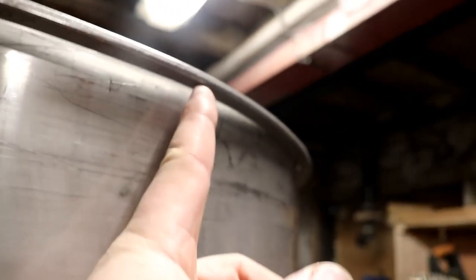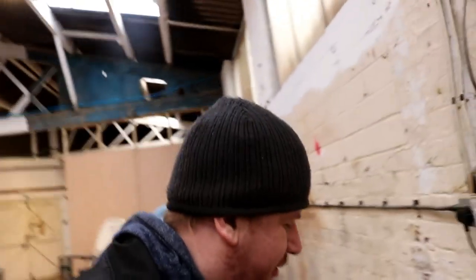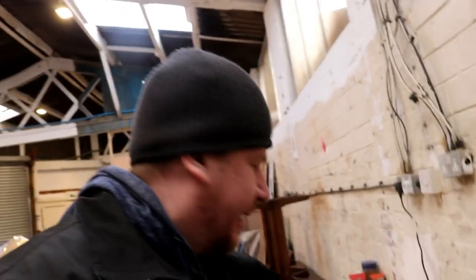The ring was just a little bit too big as we were tacking it up. So we're going to go in — if we just split it with the grinding disc, the width of the disc will probably be enough to bring it round almost, and we'll just take that in. Now we've got a belly full of chips, so I think it's time we put the kettle on and have a cup of tea.